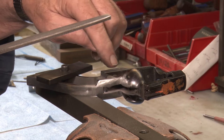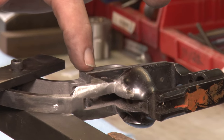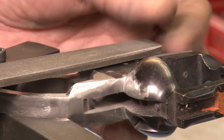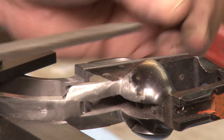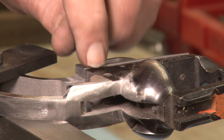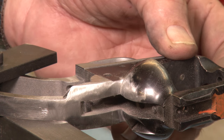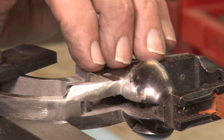Don't get into the frame and destroy any of the writing or the numbers on the side of the frame. This angle here should be the same right here down to here. If you file it just flat like that, you'll take more off than you need and you may file into the recess for the head of your screw. So what I do, I put just a little more angle on it — not like that, but a little more this way. That way I'm not touching this, and this will be just a very slight taper, and I can file it right down to where it fits that metal or touches the metal. Now it will scratch the bluing. Some people put masking tape on it. They glue on a three-thousandths thick piece of shim stock and file it down to that. But generally it's best to figure on refinishing the complete revolver when you fit a back strap.